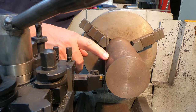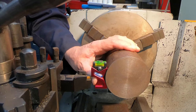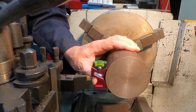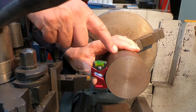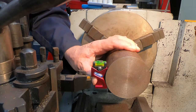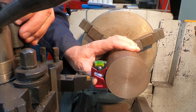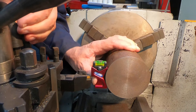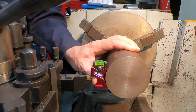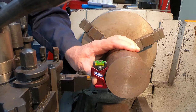I'll put a small diameter workpiece in there so you can see the difference. But first, let me show the other method I typically use — this little spirit level gadget with a V that locates on the side of the workpiece. At the moment the bubble is reading low, but as I lift the tool you can see the bubble coming up. So now we're spot on. That works quite well for larger diameters, but it doesn't work very well for smaller diameters, as you'll see.